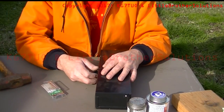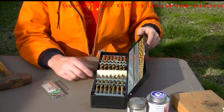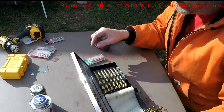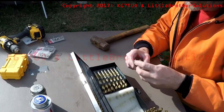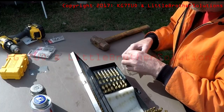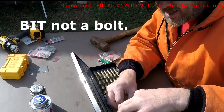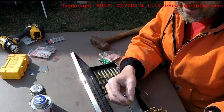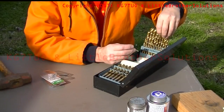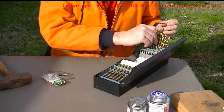While we're waiting for the glue to dry up a little bit so we don't get it all over our fingers, we can go ahead and select the correct drill bit. These are 16th-inch standard size selections. Get your number 10 bolt out and we're going to look for a bit that will make it a snug fit going in. We don't want it too loose, but we don't want it too tight either — if it's too tight, we run the risk of cracking the plastic.